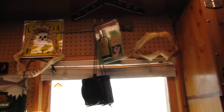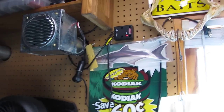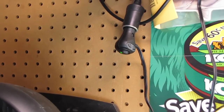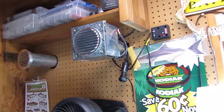My little catches, my sharks over the years. Here is the solar air heater panel — the ductwork comes from outside — and that Dayton 110 CFM fan. It's probably 85 degrees coming out of there. I built all that. There's the air intake duct, and right here is my solar charge controller. It goes down and here's my on/off switch going to my solar air heater fan and ductwork — fabricated all up here in the shop. First class job — I'm pretty proud of it.